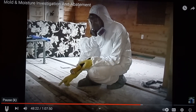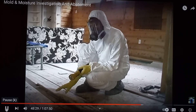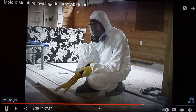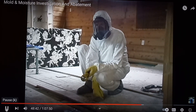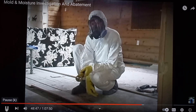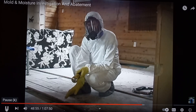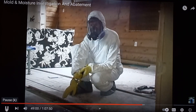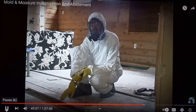This is a result of extensive moisture infiltration into the hardwood floor — you can see the severe buckling. Below the hardwood floor is an ideal environment for mold growth when the moisture becomes trapped. Areas in kitchens that have ice makers or dishwashers, or the laundry room with the washing machine, are common places to have leaks and where water may infiltrate under hardwood flooring. In many cases, the mold growth below the hardwood flooring is not visible because there are no outward signs.